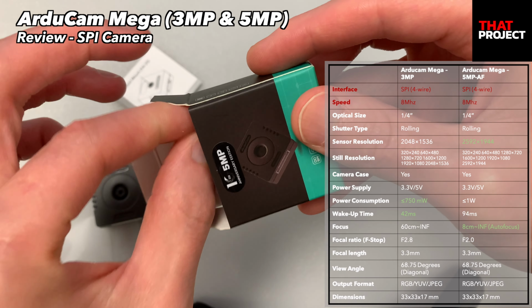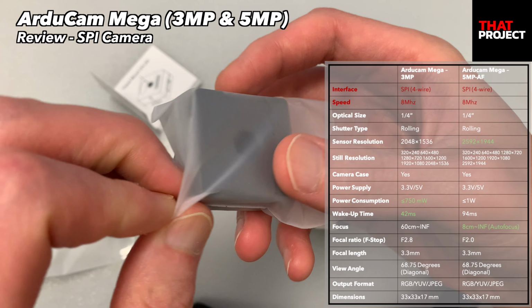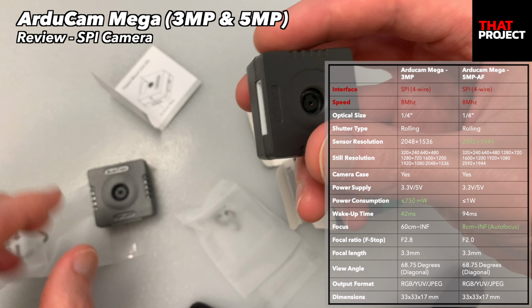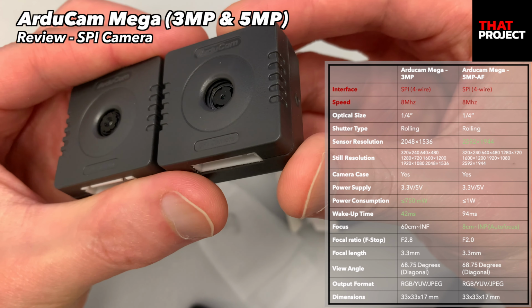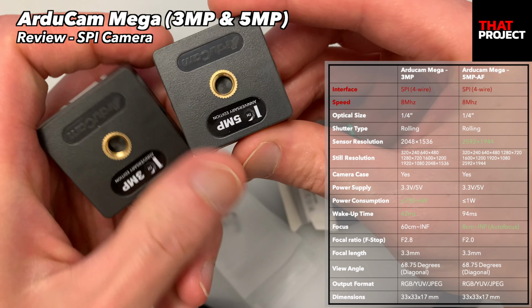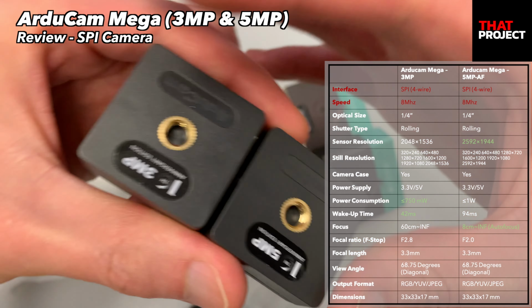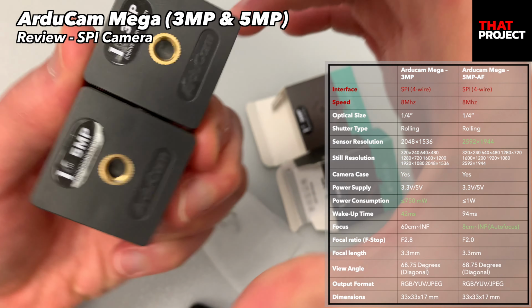This not only simplifies hardware configuration but also allows us to configure our application very simply. Also, in a normal case, we have to use a lot of GPIOs to connect the camera, but it only requires 4 pins. We can save lots of GPIOs. Not only that, we can easily create a multi-camera system too. Really cool, doesn't it? Okay, it was good.